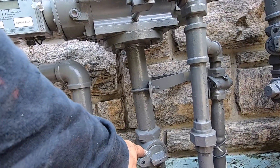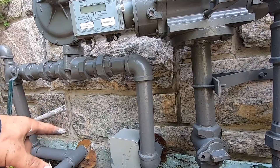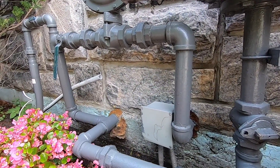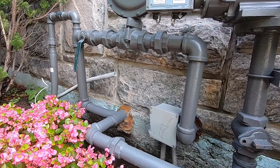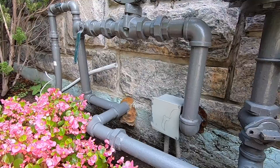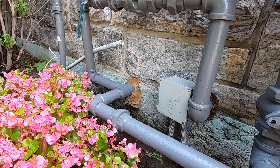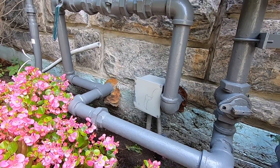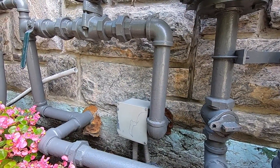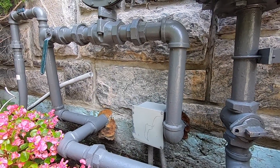So I close this one right here — once you close this one right here, we're going to get no gas where we are. The pipe said 15 kilopascals, so it's about 2 psi where we are. And then it steps down to water column — I believe that regulator is doing 5 to 9 inch water column. So it's not too bad.